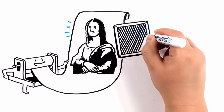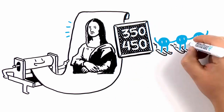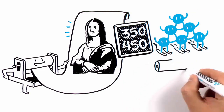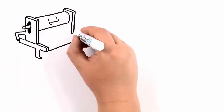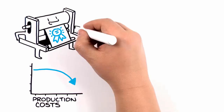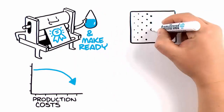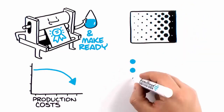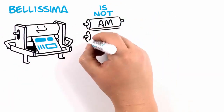Equivalent to a conventional 350 to 450 halftone screen. Bellissima's patented dot structures help overcome common press problems like bounce, barring, and slur. Bellissima's screen design delivers the same print appearance while lowering production costs with reduced ink usage and make-ready. Bellissima also addresses many common flexo problems, including min dot bridging and rivering.